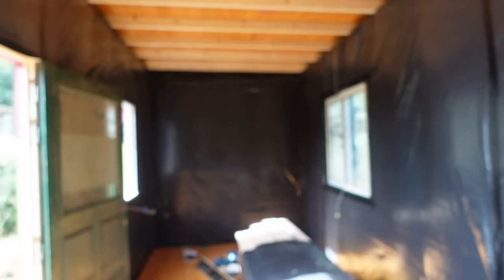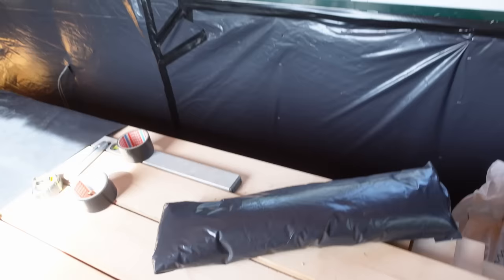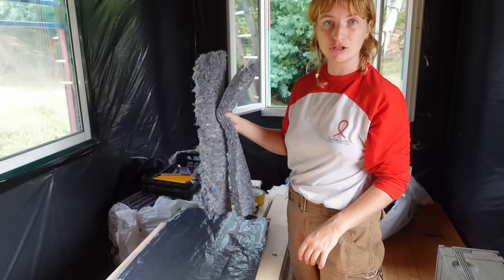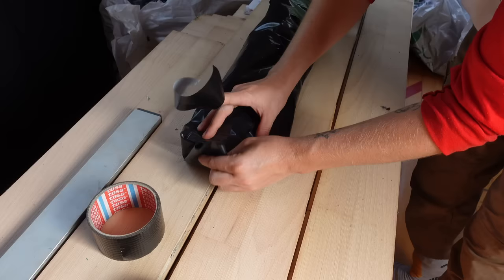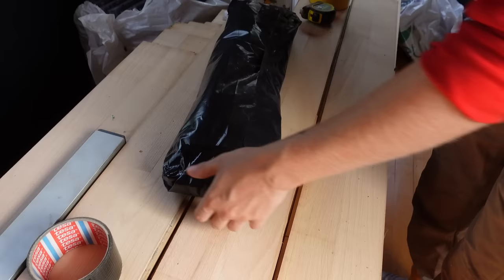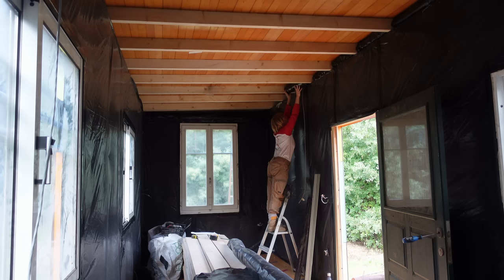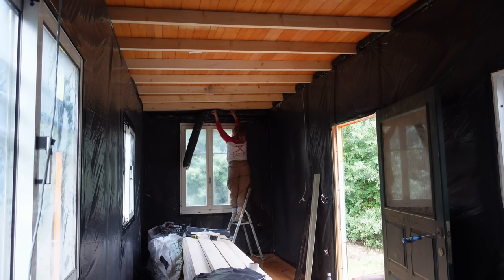As you can see the walls are meeting the roof here, but there is a little gap left by the beams. So in order to have our house completely isolated we need to fill these gaps. We're gonna make little bags that look a bit like this and just stuff them inside. We cut a piece of tarp — leftover tarp from our insulation — and leftover insulation shreds, and then we place them and make a little roll. And there you have it: your homemade cushion insulated.